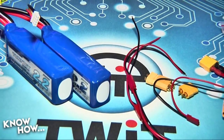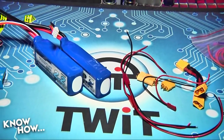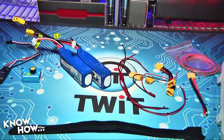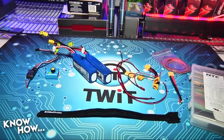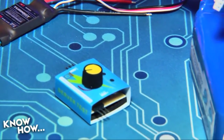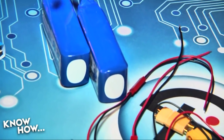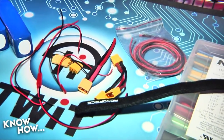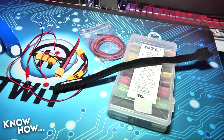We're going to need a few things. First, I picked up a Turnigy brushed electronic speed controller. Combined with a servo tester, this allows us to adjust the amount of voltage being sent to the Peltier cooler. I also picked up a set of 3S 11.1-volt LiPo batteries to provide power to our cooling unit, and a 12-volt fan to draw heat from the Peltier's heatsink. Additionally, I needed two sets of XT60 connectors, two sets of JST connectors, an XT60 Y cable, some 16-gauge or better silicone wire, heat shrink tubing, and four Velcro strips.